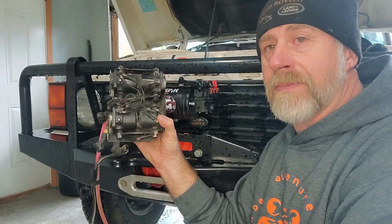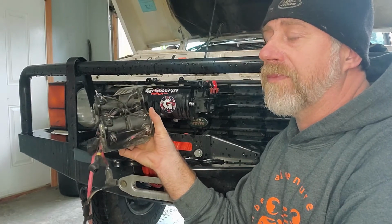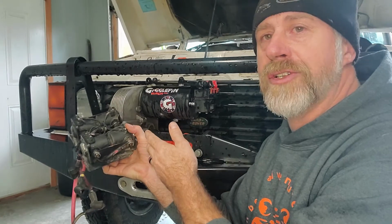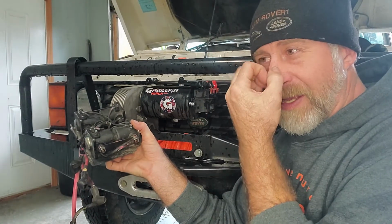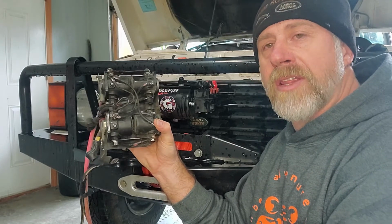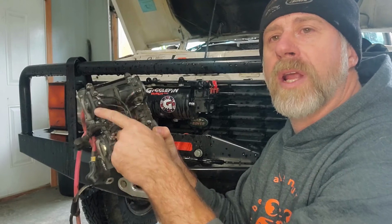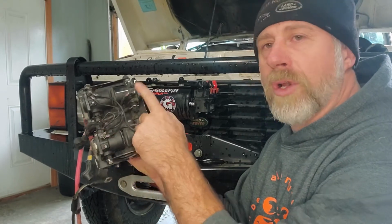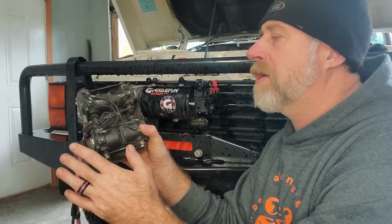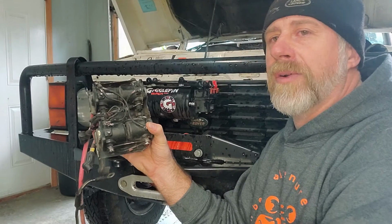If these are clicking, if they're not clicking, and you've tested your motor is good, now you got to start looking at solenoids. So if these aren't doing anything, well, you got to take this off. You got to individually start checking what's going on here. So normally they'll work one way and not the other. Very rarely will all of them just stop. So you're usually getting one way or the other when these start going bad. It'll power in or power out.